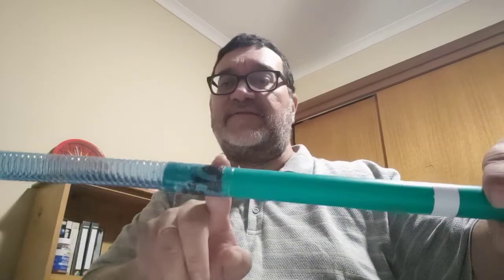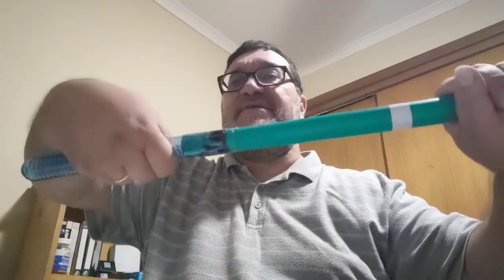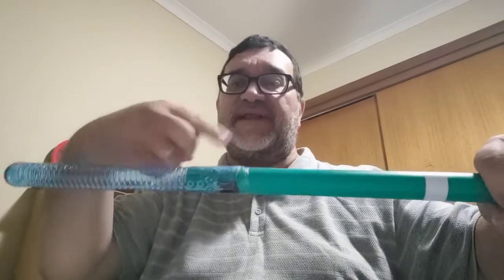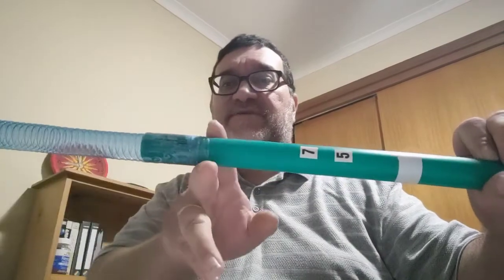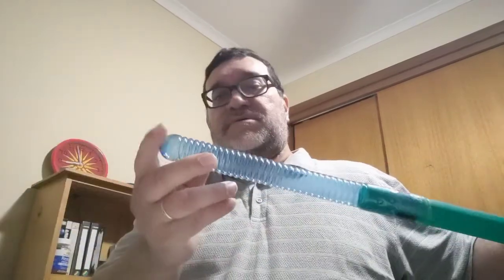I let the hot glue melt a little hotter — a little more liquefied. I applied it on the tube in an S-shape around it, then quickly slid this over it and gave it a bit of a twist so the glue can stick in all directions. All that excess glue sitting on the joints — you just get a rag and take all that excess hot glue out and give it a smooth finish. That should hold quite well, especially at high pressure.